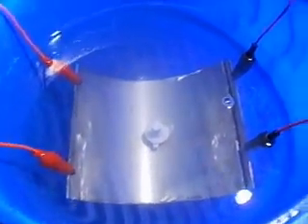Alright, now I'm going to spin it over and try it the other way, and see how quickly the water clouds up. I've shifted it around so it's in the other position. Turning it on — we're sitting about the same, just under 5 amps. That's not a bad reaction. I would say that's slightly better than what it was before. We're drawing about half an amp more. I can't even see the cell anymore. Yeah, that's definitely a better reaction.